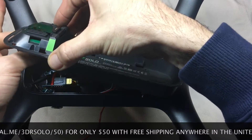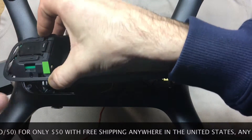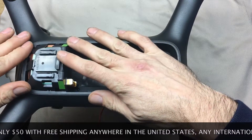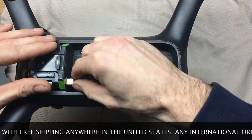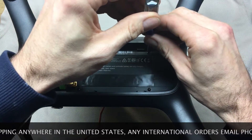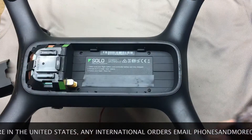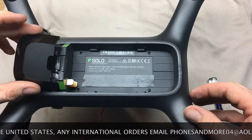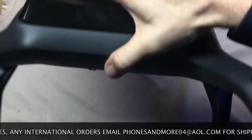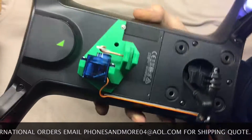Now we can go ahead and put the top back together, assuming your solder joints are nice and snug. Don't forget to plug in your GPS connector underneath — make sure you hear a nice click. This should all just fall right into place. If you're having to force it, something's not lining up, like maybe the battery connector; just give it a wiggle and it'll go in. Get all these screws buttoned down, and the cover will just clip right back on. We've got everything all buttoned down — wiring is all attached with some double-sided tape, everything's screwed together.